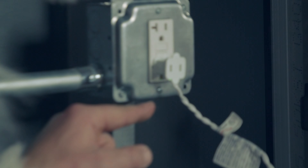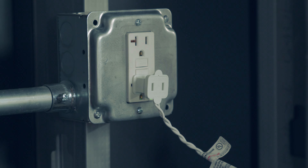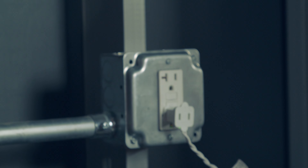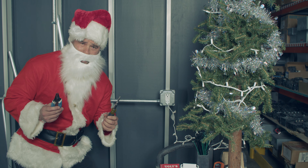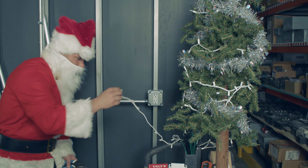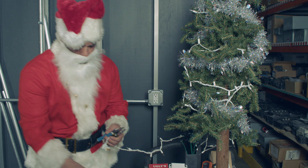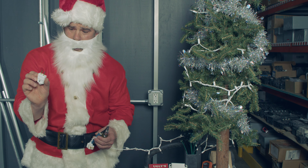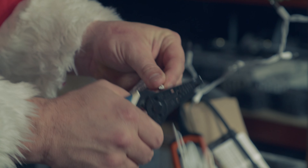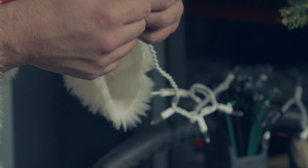You can see right there the cord has been cut, chewed, or nibbled on by a little rascal. So what I'm going to do is repair that. I'm going to very carefully unplug this so as not to get shocked, and I'm going to show you how to repair the end of a cord like this. Luckily Josh was thinking ahead and has the appropriate two-wire connector. I'm going to cut the damaged area — don't be scared to cut a little further back; a little further isn't going to hurt anything — and then you've got to strip the wires.